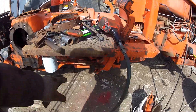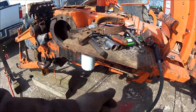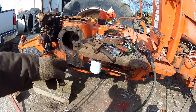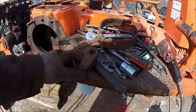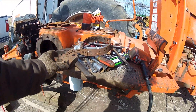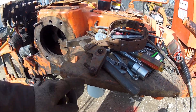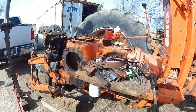I had the same thing happen on the other side — the rod broke off. I was using the brake, the rod broke, and the pedal went clear to the ground. So I'm going to have to cut this thing off, get a piece of 3/8 all-thread and weld it on there. Actually what I did before was weld a long bolt on there so I had a lot of material to weld to on the head of the bolt, and put that back in place to fix it. There it is — we're moving ahead.